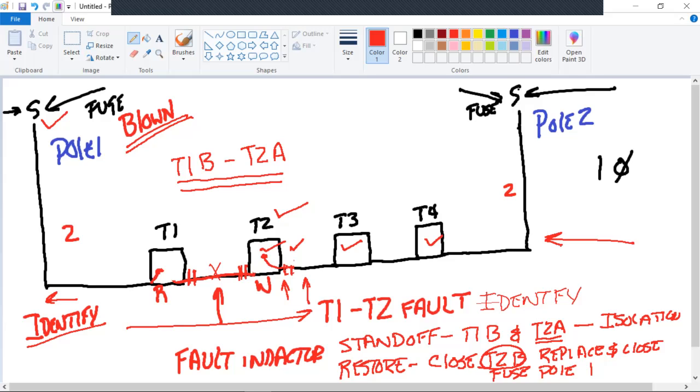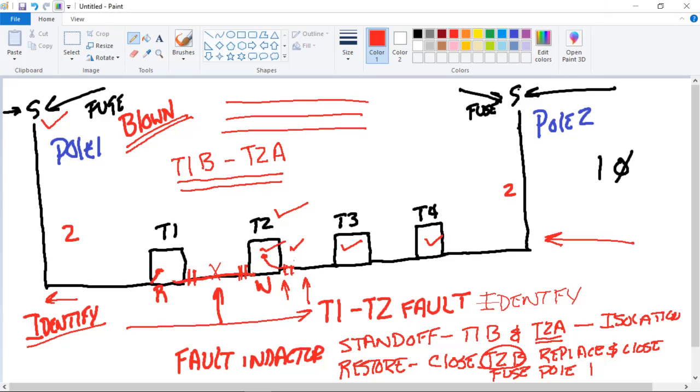If you were on overhead, you could see it in the air. It's visual. If you're working on underground, you're not 100% sure that the conductor tagging is right and you're working with the correct phase. I just want to stipulate that. I've seen a couple of accidents occur because of that. One was pretty bad to where, I'll get into another conversation about it.